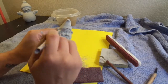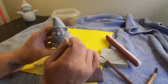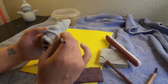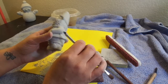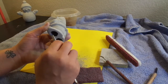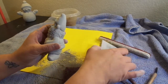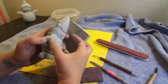It's always nice to take a little brush and get some of the dust off so you can see what you're working with. Don't ever blow your dust — it gets all over the place and the person sitting next to you in the studio is not going to be happy. This dust is so fine you really don't want to get it in the air, as everybody's got allergies and that sort of thing. This little hole here is an air pocket — it was created when something touched inside the mold when we were fettling and getting that excess clay out. This one is just a little air hole that got trapped in there. I'm going to go back over one more time with the fine sander to help get rid of all those little scratchy marks.